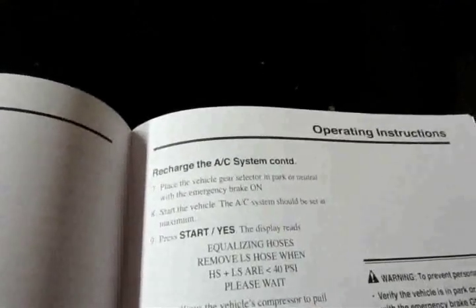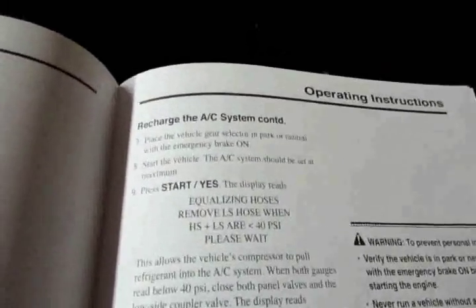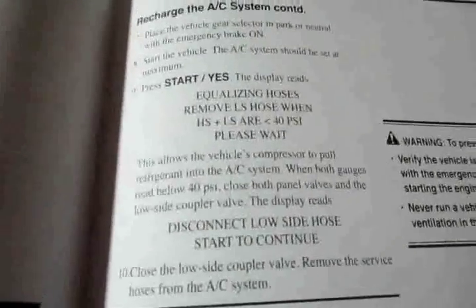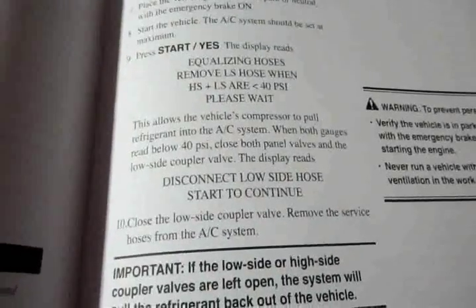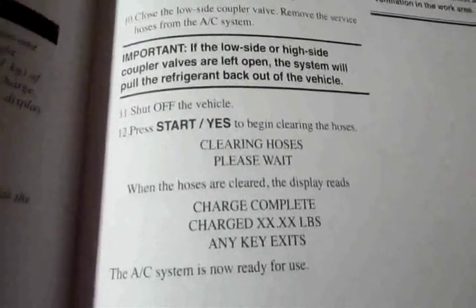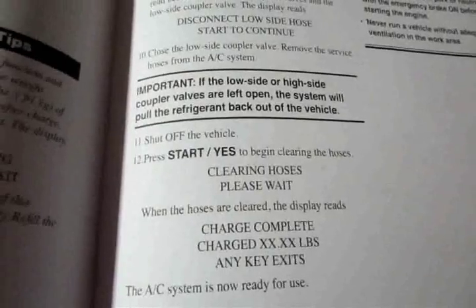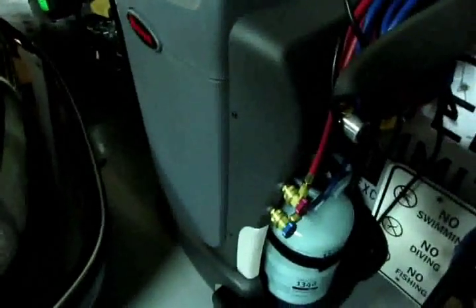It definitely blows cold. I replaced the valve that was leaking, sucked all the refrigerant out, pulled the vacuum, added more oil. It seems to work — I think there's oil in the system. We've got to turn this off because we're getting asphyxiated in here. At 86 degrees outside it definitely works. Now I'm wondering — when I recover refrigerant next time, maybe oil will come out. Maybe this compressor was leaking or slinging oil for a long time.